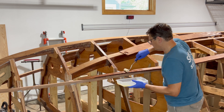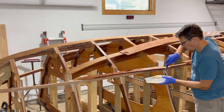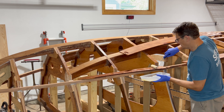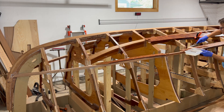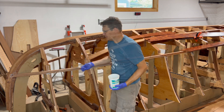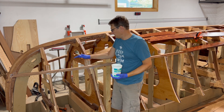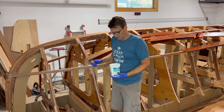This is my first time doing this, so we'll see if I got this right or not. Now I'm going to put unthickened epoxy on the top chine rail and in these notches, and then come back and fill them with thickened epoxy.